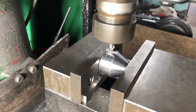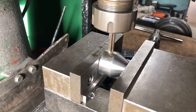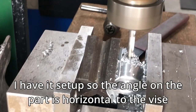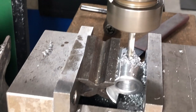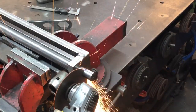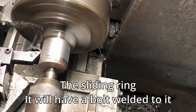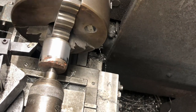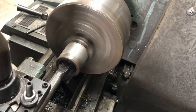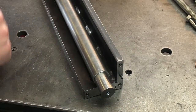I need to drill a couple of holes here. The first one is for a grub screw — drilled and tapped to M8 — and that'll stop this piece slipping on the bar. Then there's drilling and tapping an M12 hole for the handle. Now I cut the excess bar off to the right length. I start working on the part that goes onto the eccentric bar and bore that out to 25 millimetres so that it slides onto the bar, and that works very nicely.